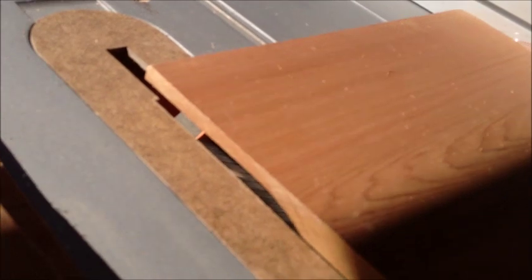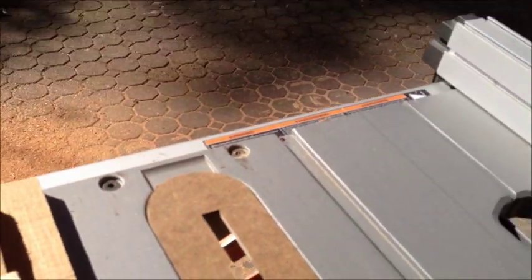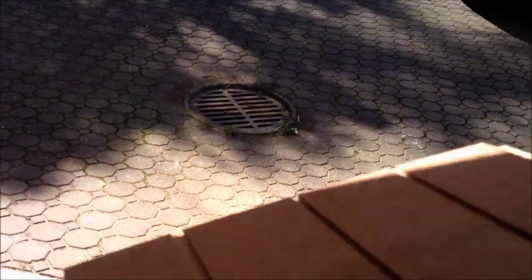There's the dado blade. I'll just turn on the table saw and push that through — it's very easy. And I've done all four, and now what I'll do is put another one around the top — that'll be the beehive frame shelf and we'll go from there. So there's the board, nicely cut, with a little rabbet edge on all three sides.